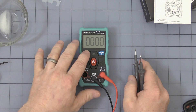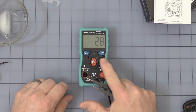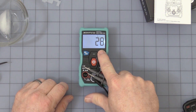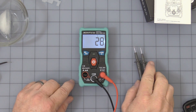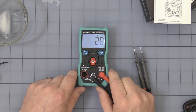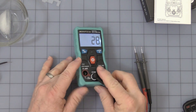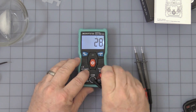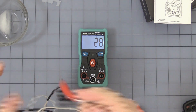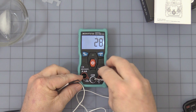Press it again and you get temperature in Celsius. It has one degree Celsius resolution. There is a built-in thermistor inside the unit itself, but it has a very slow response rate because it's unclear exactly where the thermistor is on the inside. If you disconnect the built-in probe and hook up the external temperature probes that come with the unit, you will get a much faster response.